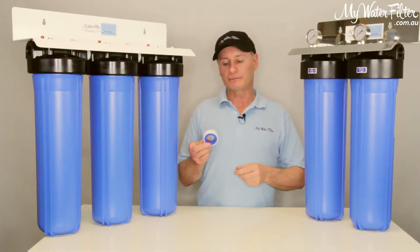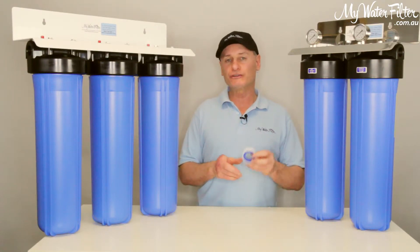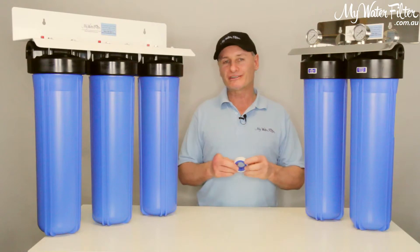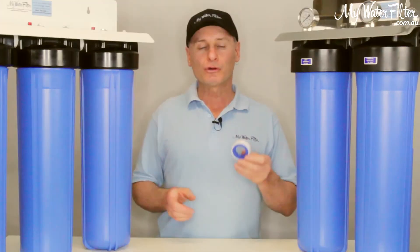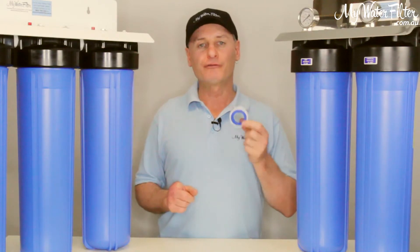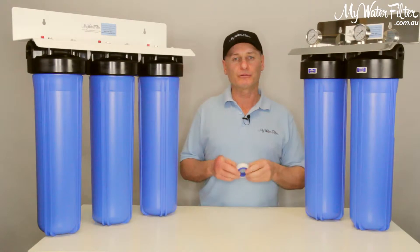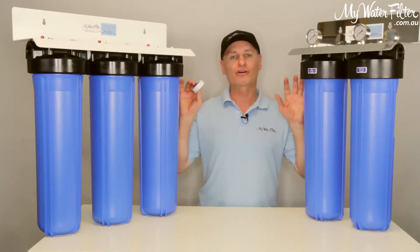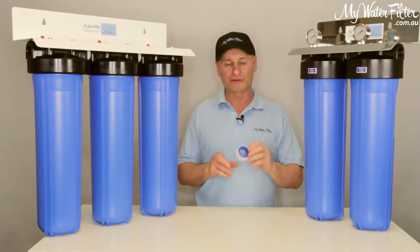You'll see other thread tapes around — a lot thicker. Gas tape, yellow containers, pink — sometimes the thread tape's pink. So when you're doing water filtration, we want to use plumber's tape for water. Plumber's tape, steel pipe. We're not gas fitters and we haven't got gas connections — we've got water filtration here. So we don't want to be using the big thick stuff.